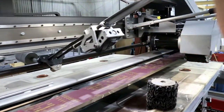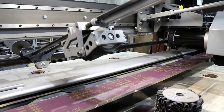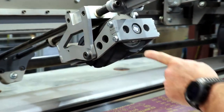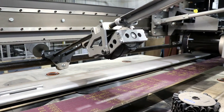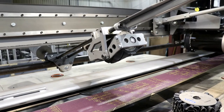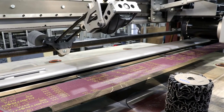We have the groove contact wheel. The groove contact wheel allows removing material faster because it has only one contact point with the abrasive belt. It also allows a better finish on stainless steel and aluminum materials.